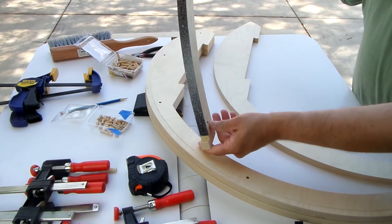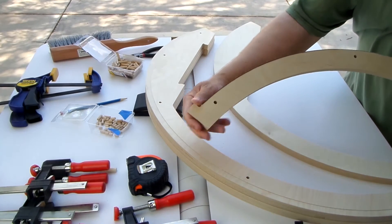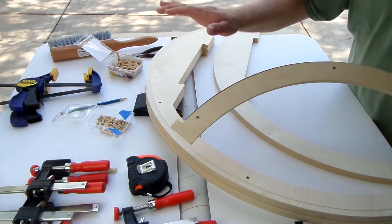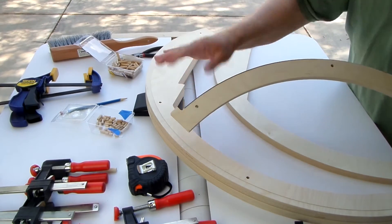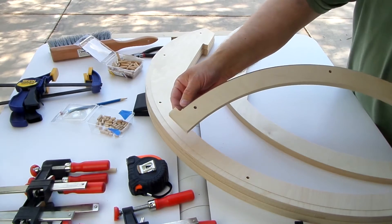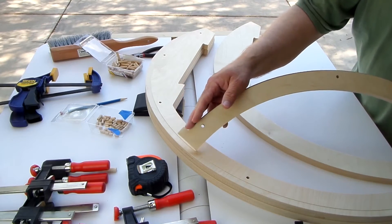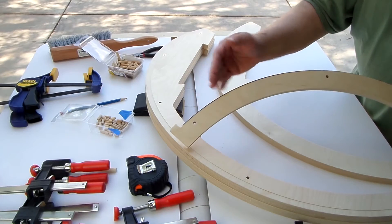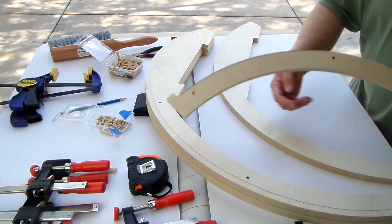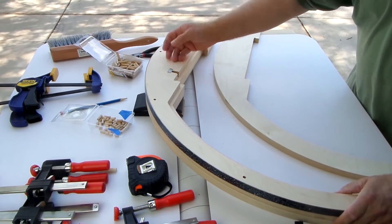This layer also has a neat feature on the end of the laminate here. The CNC design has an end plate on it, so when the telescope goes all the way down or all the way up it hits on that with the Teflon, and that stops the motion of the telescope. The telescope can't go too far forward or too far back in its motion, so it's a nice safety feature that's automatically in place.